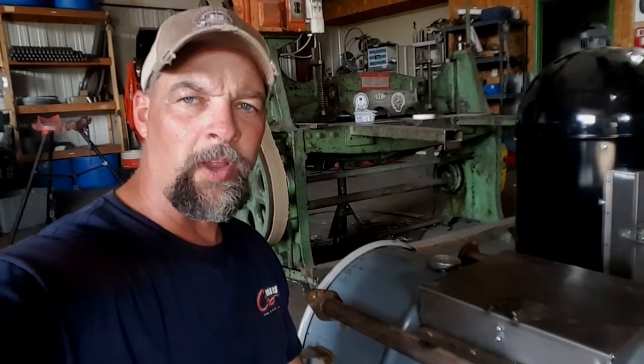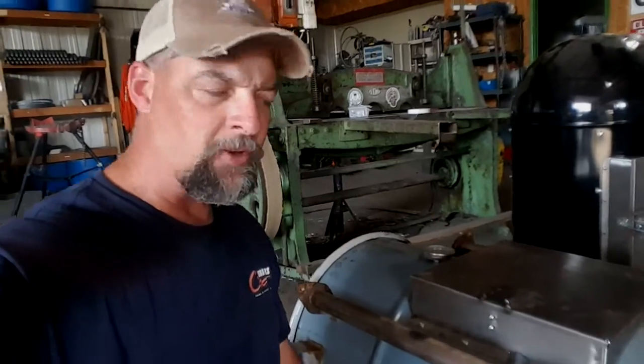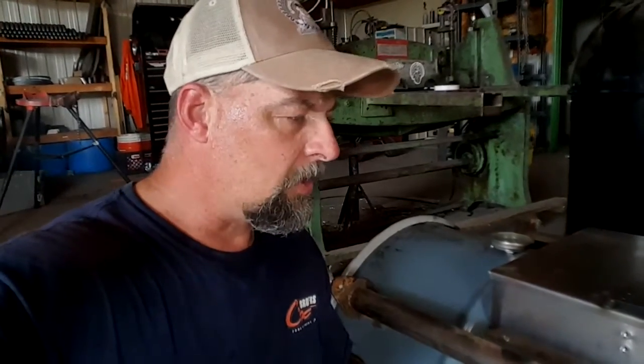All right, folks, I'm back. I went ahead and took the time real quick just to notch this door out and get it mounted to the drum. Another thing I said in a previous video is that it's okay to use self-drilling 5/16 head, number 12 screws. It installs a lot quicker. The door comes with 1/4-20 nuts and bolts, so you can drill holes and bolt it down a lot tighter. If you're using gasket material, the Lavalock gaskets, I do recommend using the nuts and bolts. But heck, you could even weld this on here if you're a welder.